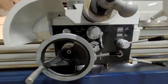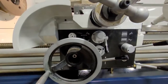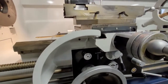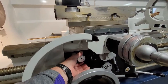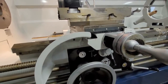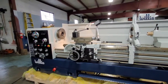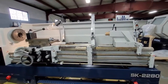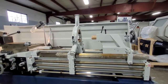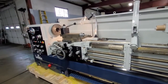The apron also does pull oil out of this gearbox and it does automatically lubricate the bed way and the cross slide way. You can control that auto oiler by turning it on here, and when you have enough oil, you can just turn that off. There are also many other areas on the machine that should get oiled regularly. Please refer to the operator's manual for types of oil, quantities of oil, locations of where it should go, and how often it should go.